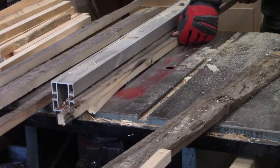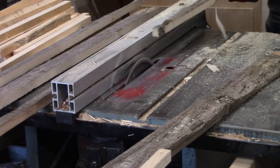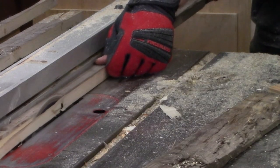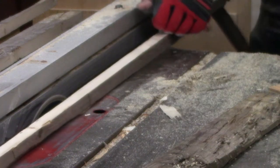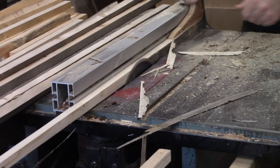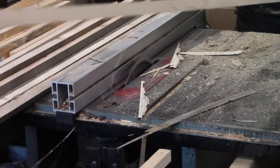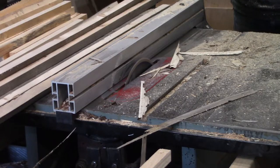And here's something that you should be aware of. This wasn't a kickback, but it did throw me off for a second. As I was pushing through the thin stock, there was a weak point that snapped between the blade and where I was pushing, so things got a little bit squirrely. Nothing too major, but something to look out for if you're using the same type of stock with that type of defect in it. Something else I should have done was take out the nail tops that were left behind when I took the pallet apart. I knew the table saw blade was on its last legs, so I wasn't too concerned about damaging the blade itself, but it did end up throwing a little bit more sparks and shrapnel at my face than I was expecting, or would have preferred. So that's something else to look out for.